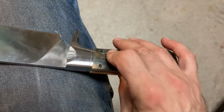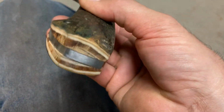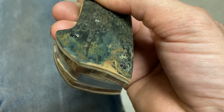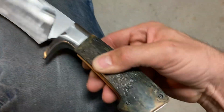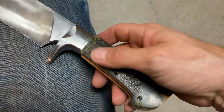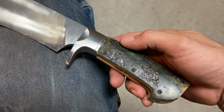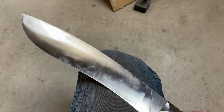And then also I got to take the fronts of these down a little bit, and then I got to trim actually the end of the handle frame back a little bit shorter so I can get that proud fit on that facet. So a little fussy work left, but the whole knife is fabricated now, and now I just gotta finish dimension the ivory, polish it, and then it's take them off, hand sand the blade on the edges of the frame, and etch it.